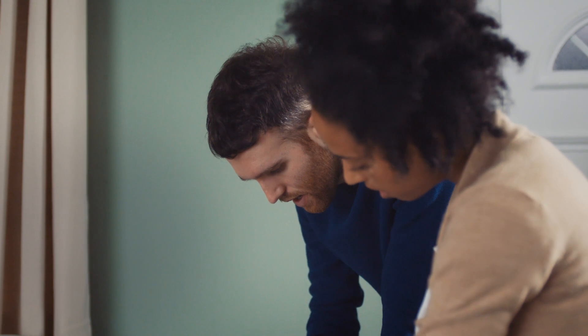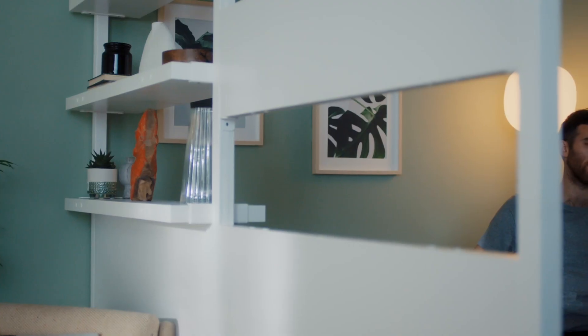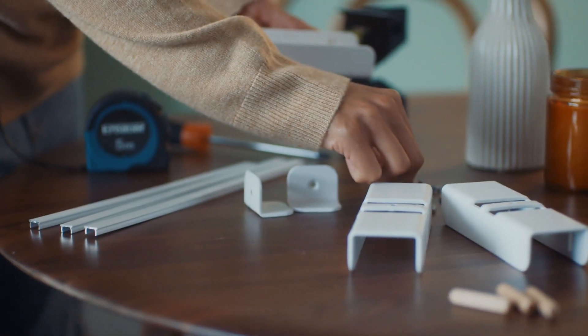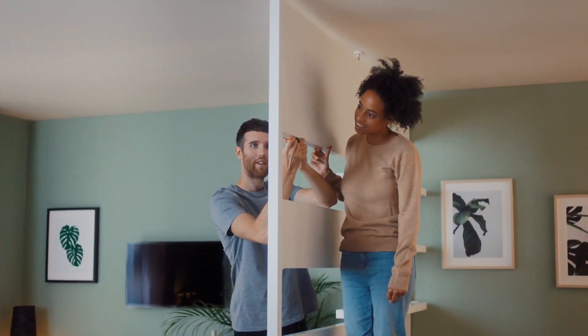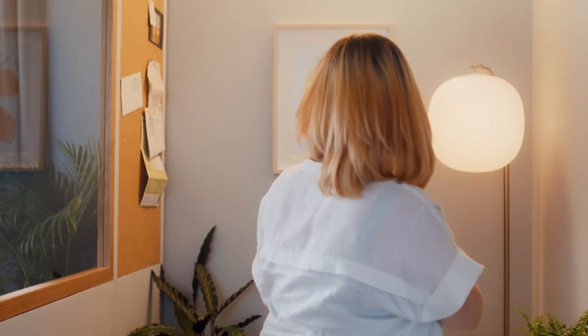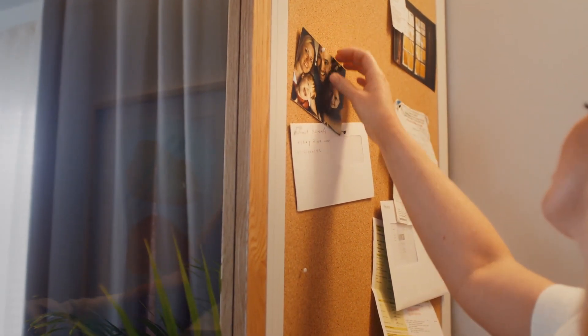Now that you have a clear plan of your layout, you can replace any 100cm by 100cm section with shelving, a spacer section or a feature panel. If you want a shelving section, you will need one shelf bracket kit which comes in a pack of 6, and 3 100 by 25cm panels. For a spacer section with 2 gaps, you will need 2 spacer kits, which come in a pack of 2, and 2 100 by 25cm panels. You can also use spacers and shelves on sections less than 100cm wide by using narrower panels, or replace a 100cm by 50cm panel with a cork pin board, or combine 2 to replace a 100cm by 100cm panel.